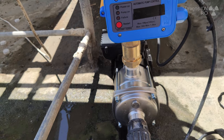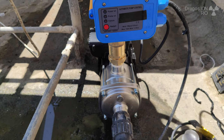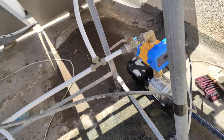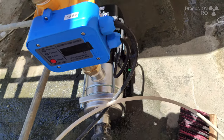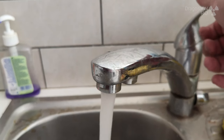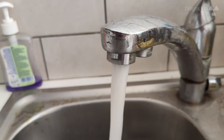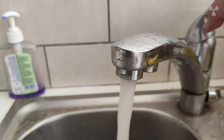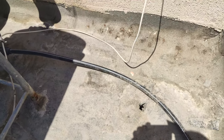The button is to reset the pump if there is any error for the control module. Starting to test it to see if it starts. Arrange the wire a little bit, just with a bit of tape, making a few loops so that if there is any water on this cable it doesn't go inside the box - it goes down like that. You might have a bit of air in the pipe so there shouldn't be any surprise if you see a lot of air coming out - it's normal, it will go away eventually. The pressure is great and it's working. After a few days all this water is gone, it's nice and dry. It's perfect, it's working.